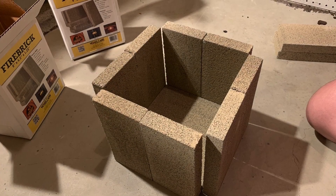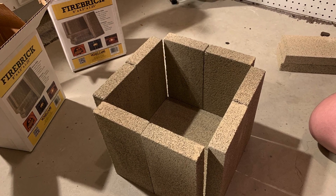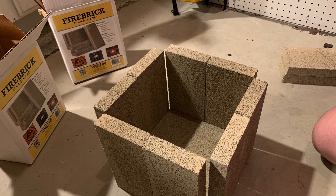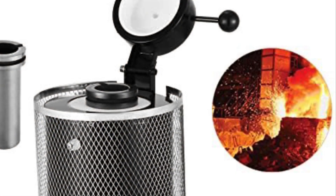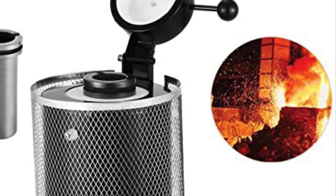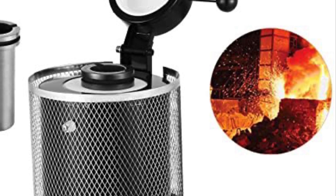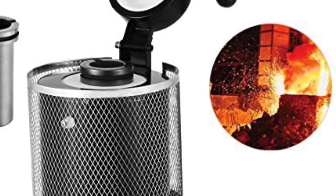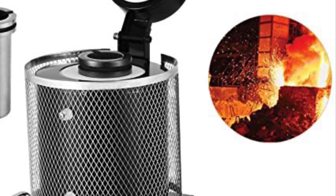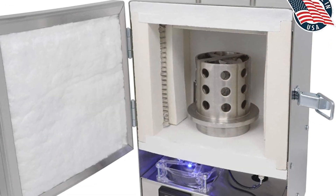For my design I went for a box because I wanted to optimize the amount of space and fit the biggest flask possible. Electric furnaces are made to get super hot, so you need a ton of insulation and not a lot of excess space — that's why there are cylinders. If you're trying to make one of those you could go for a cylinder, but I suggest a hexagon because cylinders are really hard to make into furnaces.